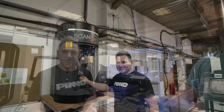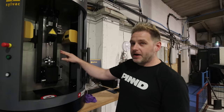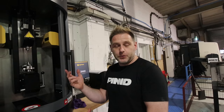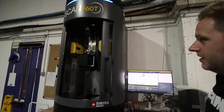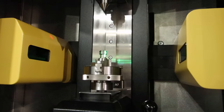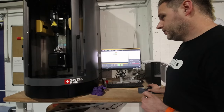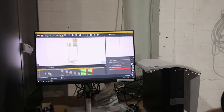Here's something new they didn't have last time — it looks pretty futuristic. It's a scanning machine for measurement. You scan the part and it tells you the size and whether it's in spec or out of spec, and it does it in seconds. It's mainly for quality control — you put the first-off part on here, check the sizes, and if it's good the inspectors can verify the data throughout that run and see if sizes are moving. It also checks threads — no need for a thread gauge. Everything's mostly green, with a couple of issues on the thread that can be attended to. It's colour-coded and shows how close you are to being out of spec.